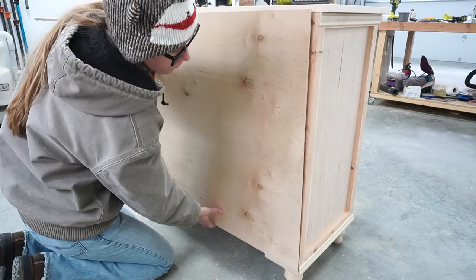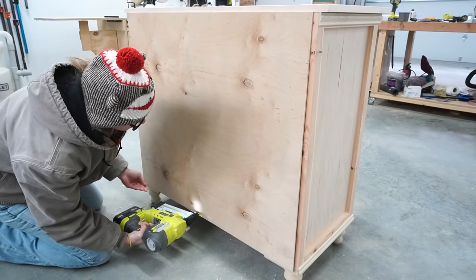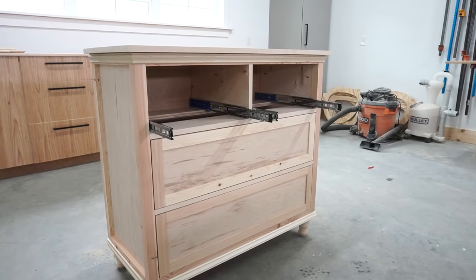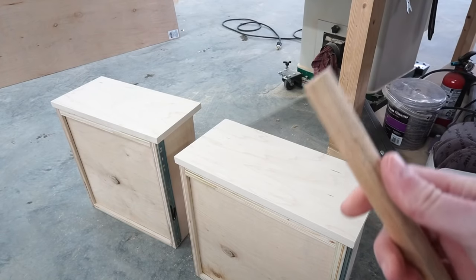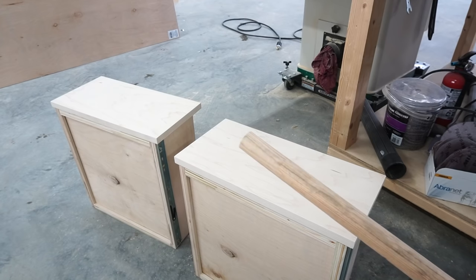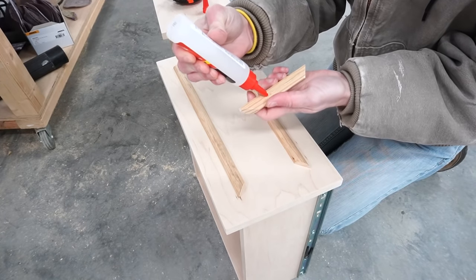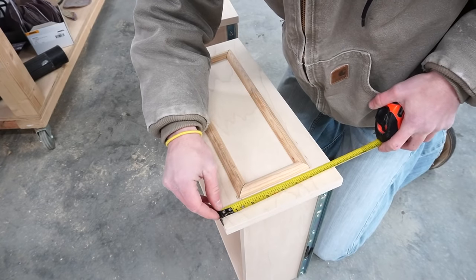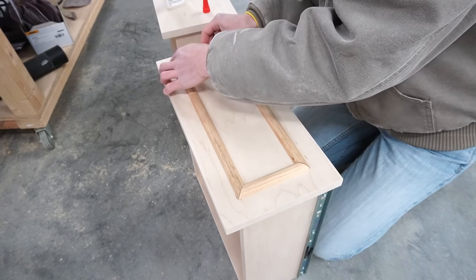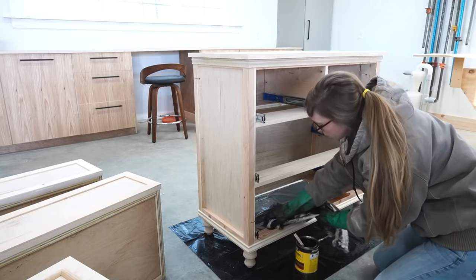To finish off the build, I cut and stapled a back panel onto the back side of the dresser. After the back was on, I thought I was finished, but the more I looked at this dresser, the more I thought it needed one more thing. Confession time: I removed the top two drawers because I'm going to add some trim on them — I just wasn't really happy with the plain flat drawer fronts. So I had some scrap half-round molding in the shop, and I cut this just to make a design on the front so that these aren't totally plain. I think it'll look better proportionally. I cut some half-round pieces with 45-degree miters and used some quick-dry wood glue to glue these pieces onto the front, keeping the rectangle centered side to side and up and down.